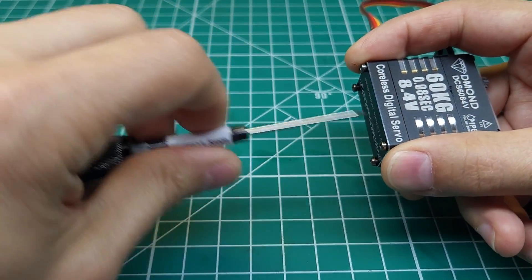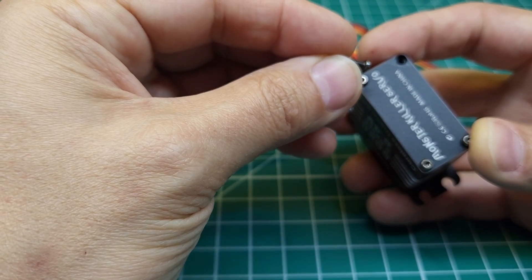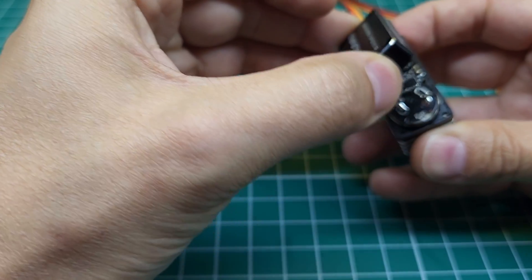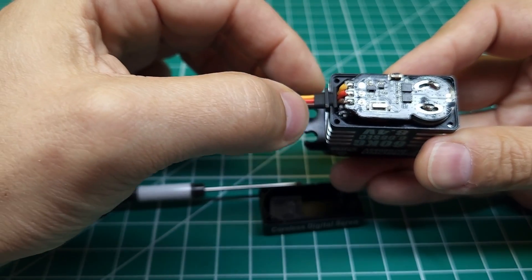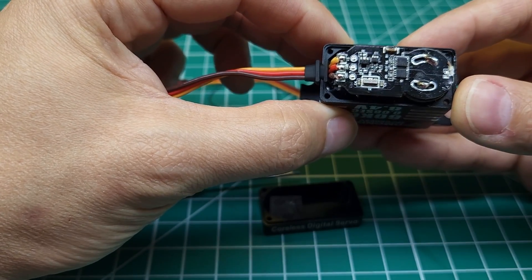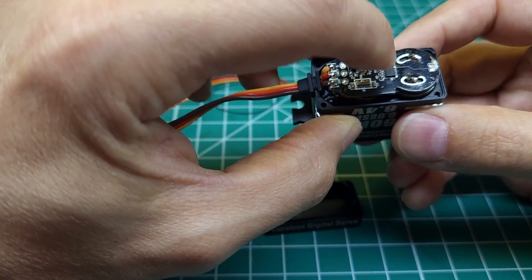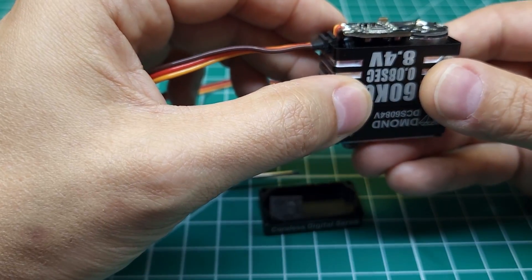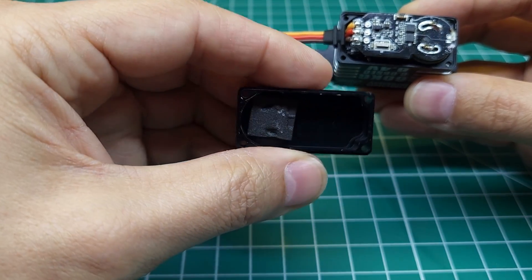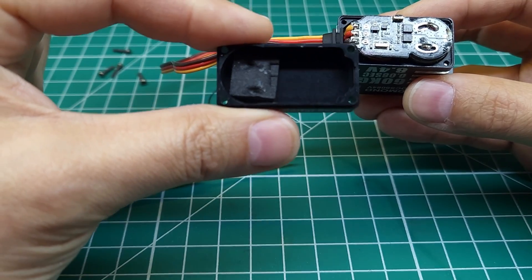Got these screws out. This is a really nice-looking all-aluminum case and the screws look nice. First thing I'm noticing is there are no O-rings on these screws, which makes me a little nervous about waterproofness. There is an O-ring around the bottom cover, but it goes up and over the grommet for the wires, so I'm not entirely comfortable with that being waterproof either. The board looks pretty nice. There is definitely no waterproofing on the screw holes, so IP68 water resistance is almost certainly not going to happen. IP68 is like three feet for 30 minutes — I wouldn't trust that.